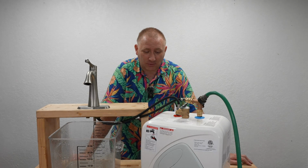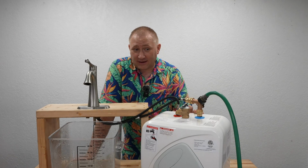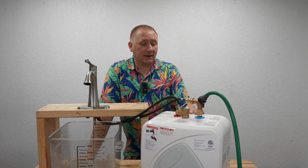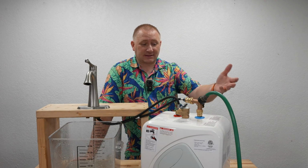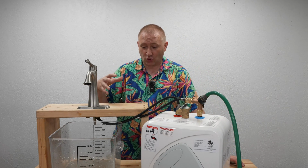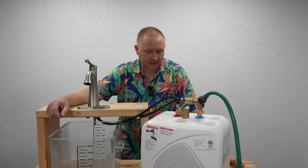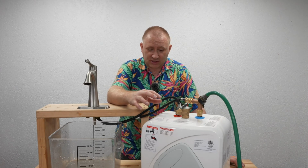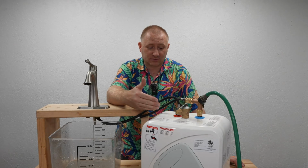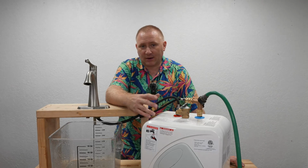A small little water heater like this, all electric, so you do need an electric hookup, and that should be a GFI or ground fault hookup for power. Outside of that, pretty simple. In my case, obviously I rigged it to work in this specific scenario, but it was easier to show you how this worked in this environment than climbing under the cabinet to install it. This can just be set down on the cabinet underneath. There are multiple ways to mount this in the cabinet or just set it in the cabinet. And of course, power is power.